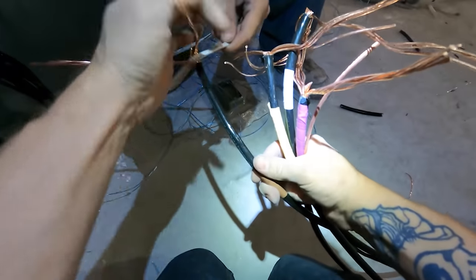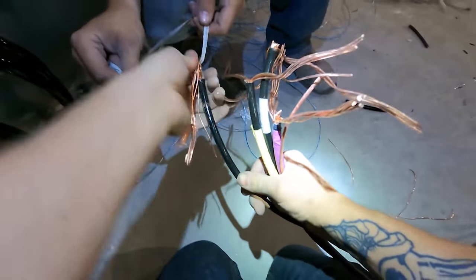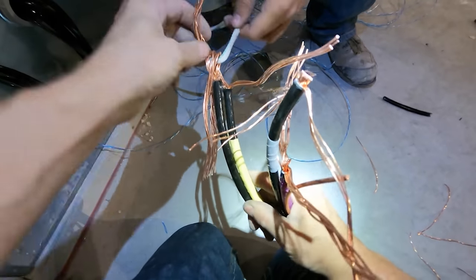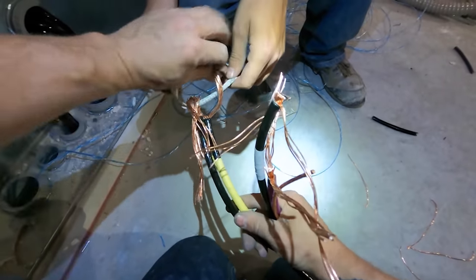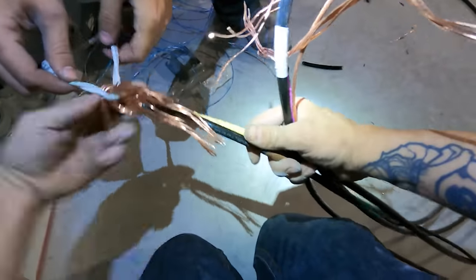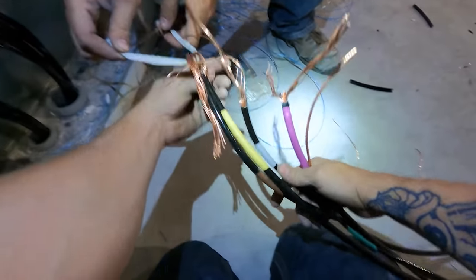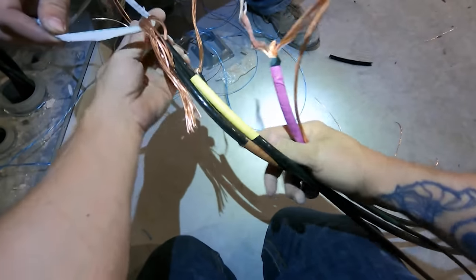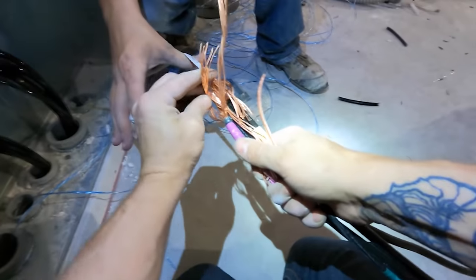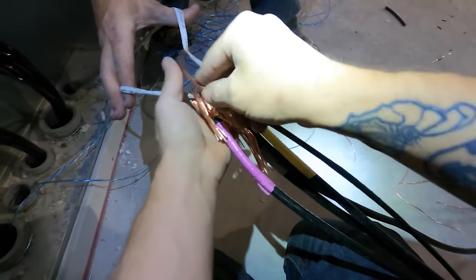As a general rule of thumb, I always try to make everything as round as possible because inside the conduit it's smooth edges. Every once in a while you'll have two pieces of conduit that butt up to each other with a coupling, and sometimes when you tighten down too much it can squeeze one end of the conduit, creating an edge that something can hit. If you have any flat, hard edges you can get caught on stuff. Just try to make everything as smooth as possible — a round head negates any kind of edges there might be.